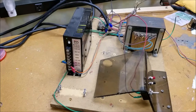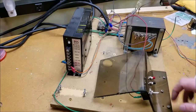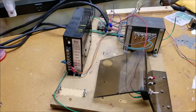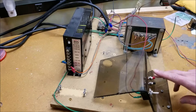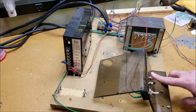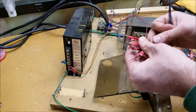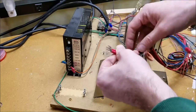Here's the test bench. We've got our power supply, our isolation transformer for the monitor, and our control panel with an on/off switch and a couple of momentary buttons — one for coin up and one for player one start. The next thing we're going to do is wire in the power wires, then run wire over for the two momentary buttons. The first button will be coin one and the next will be player one start.